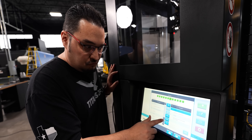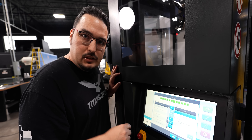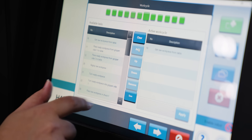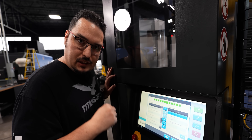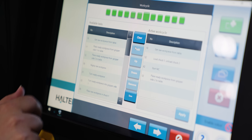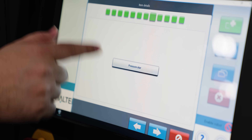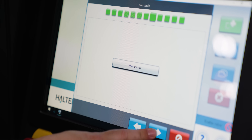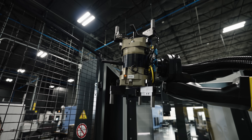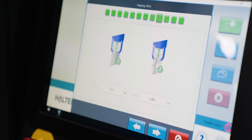Here's where you actually make your program, and it's really easy. They give you a whole bunch of operations in the left column and you're basically just telling it what order you want to do things — it's almost drag and drop. You select which one you want and add it to the second column. Our program: first step is to grab the work piece from the table, then load chuck one, unload chuck two, then start the machine — giving it the go ahead to run the machine cycle. While it's doing that, it grabs the finished work piece from gripper side two and places it back on the table. If you need a different kind of cycle, you can customize all of these in the software. After that, it asks if you want to use the pressure sensor — we have it set up on side one of the gripper but turned it off for this example. Then we have the gripping offset, asking for the rough piece and finished piece — this is the distance from the face of the gripper to the back end of the stock. We're gripping raw stock on both sides so these numbers are exactly the same on side one and side two.